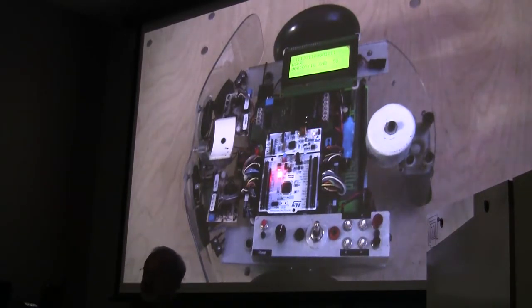Every system in the robot has an enable flag associated with it, whatever it is, lighting the LEDs, turning the LCD on and off, running pulse width modulation. Every function has a flag. And here in this particular menu, those flags are all gathered together in one place. So by looking at all these ones and zeros, I can tell the whole state of the robot in a single place.